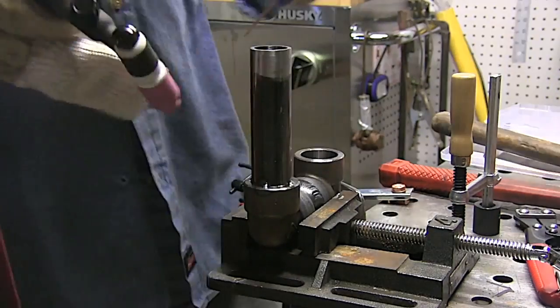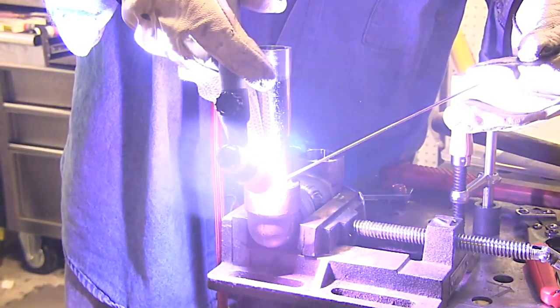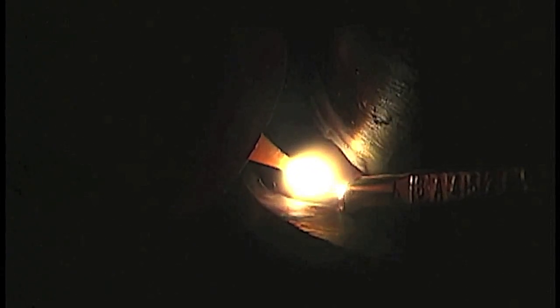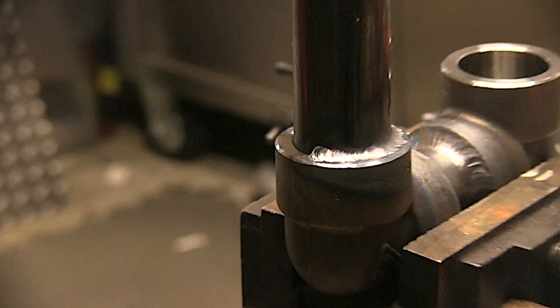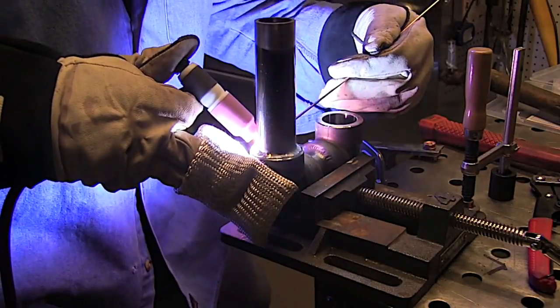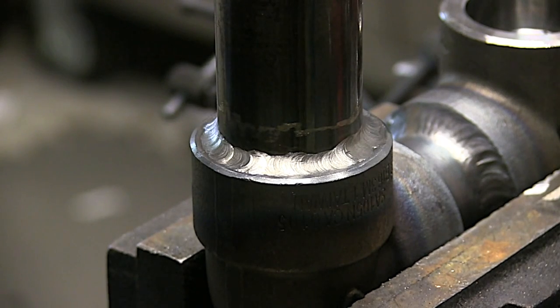I'll come at it from the top here just to show how I would freehand it — it's really just a straight-on motion with no real wiggle. Just a gradual motion moving the torch ahead and pulling that filler wire around to match the torch angle as you go. If you can't come in from the top, you'd have to prop like this, which is really close to the weld and would toast your knuckles without a TIG finger or something homemade to guard the heat. Fingers never even got warm at all.